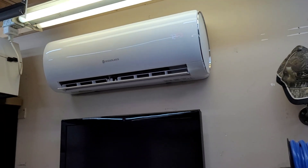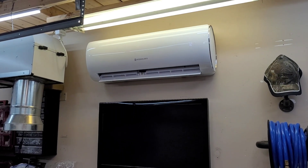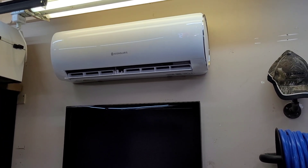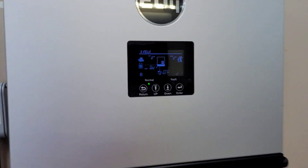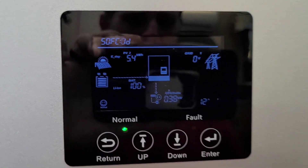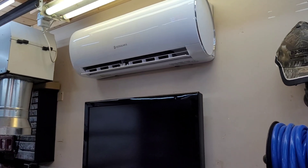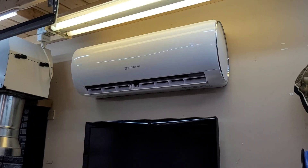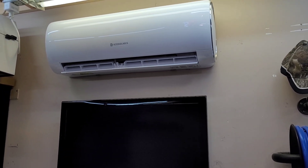For the next 24 hours, this heat pump is going to be set to 72 degrees keeping the garage cool. The current temperature in the garage is 80 degrees and the outdoor temperature is about 88. That's an eight-degree differential, so this thing is going to ramp up pretty high. On the 6000 XP we're pulling 370 watts on one leg and 380 on the other — coming up on 800 watts right now.